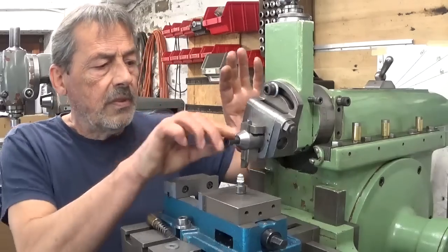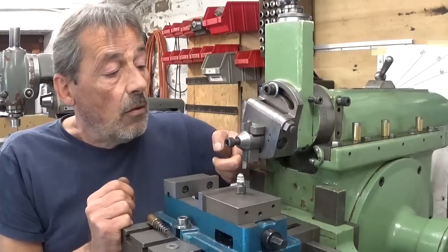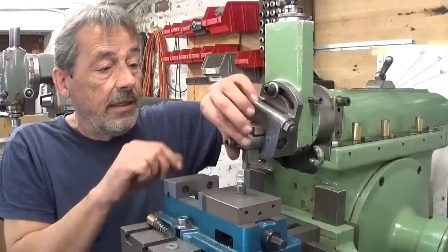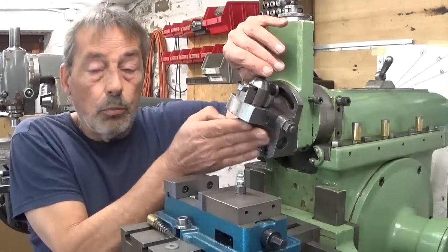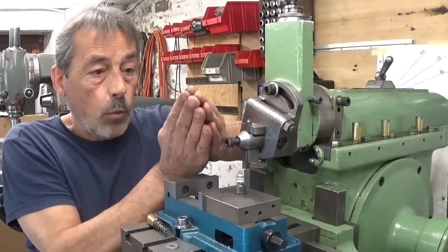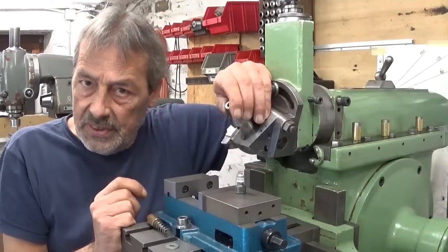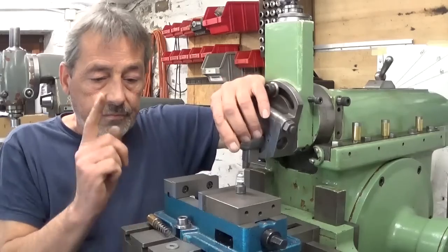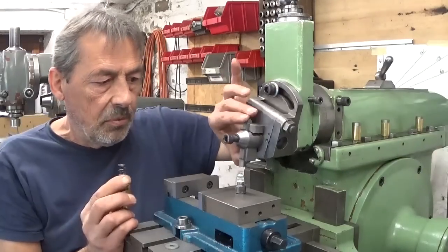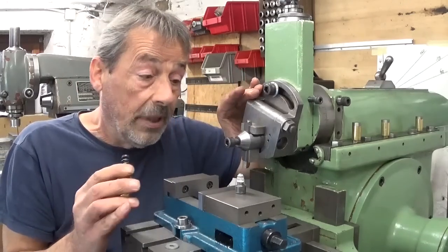So now I take care that there's absolutely no oil, because when I push the clapper with my hand, I can feel the suction of the air here behind. This is a nice, completely flat surface, and this too, and you really feel the air sucking in. Because of the stickiness of the oil, of course, it's going to be a bit hard. Since I use my spring system here to limit the movement of the clapper and limit the bouncing effect, I don't have this problem anymore.